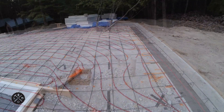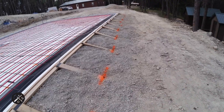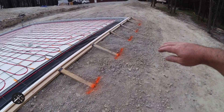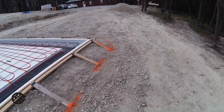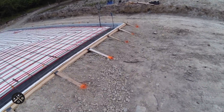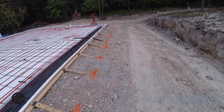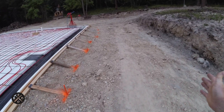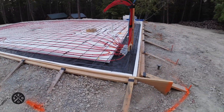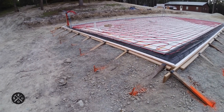I went through and marked where all the stakes are, especially on the side where they could potentially drive down — it's a little tight up by the bank. I used high-vis marking paint so the truck can see when he's backing in right where my stakes are. They go back and forth a little based on where the braces are. I did the front as well, and marked this side so they can see it well with their mirror. The concrete guy came out and did a site evaluation and said he can pour it all from one side if he has to.